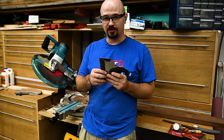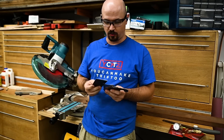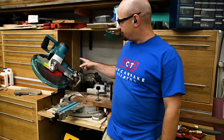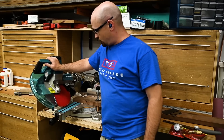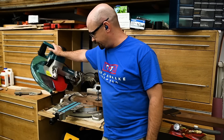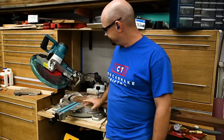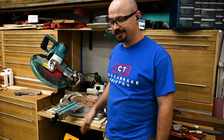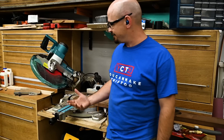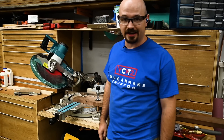For all my card scrapers, I'm just going to cut some slots at an angle that I can drop these in on a board. What I've done is set up my miter saw at a bevel with the depth stop on the blade so it doesn't go all the way down — only a partial depth cut — and I'm going to make a series here. This is my third miter saw, and I think the first time in the decade I've had miter saws that I've ever actually used the bevel feature, but glad I have it now.